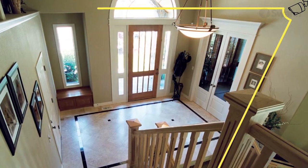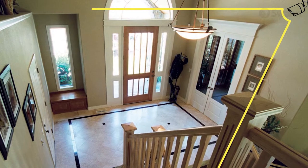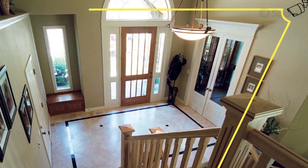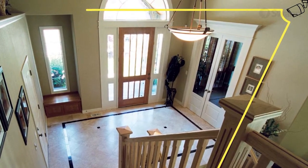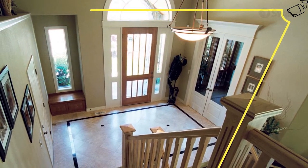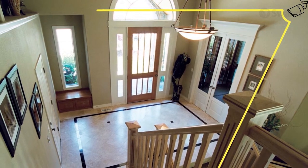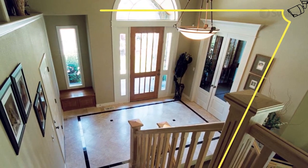For example, if your target is the front door, position the camera indoors so it can see the door and the surrounding areas, so you can capture someone entering the area as soon as they're inside, and not just the door itself. Most burglars will enter your home through the front or back door, so it's important to install a camera or cameras here. It's recommended to install the camera either above the door or to the side.